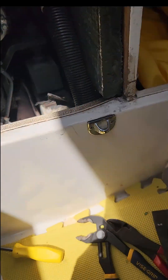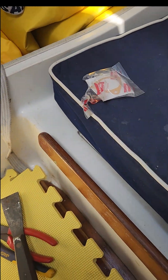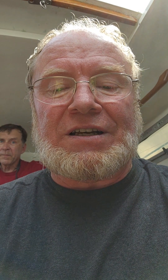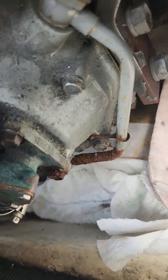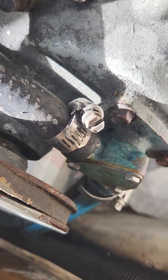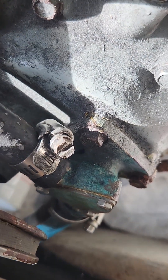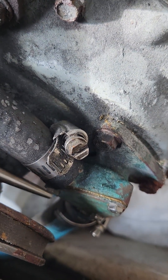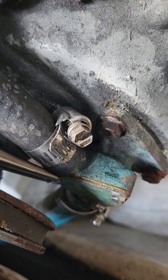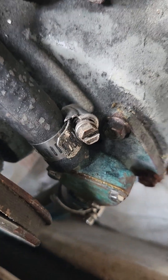Just to show you that the impeller actually looks okay, but it's not. I'll put it down here — it doesn't look that bad. Impeller's in, cover's on — just to show you what it looks like. That was three bolts down there; the one that's back up here is behind the pulley. So you need a pair of needle nose — hold that bolt on the shank with the needle nose, push it in with your finger, then use the needle nose to get it started. That's a little trick for you.